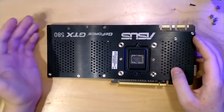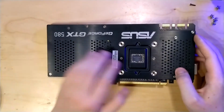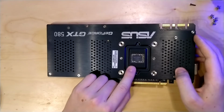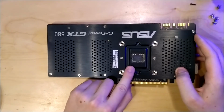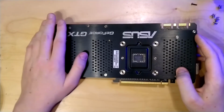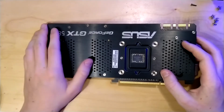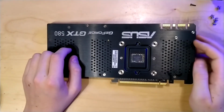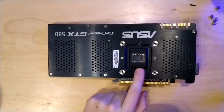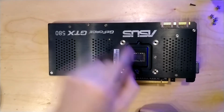Now, yeah, this is pretty much what these Proadlizers are intended to be used for, but actually I only ever saw them on one other card, being the Gigabyte Radeon HD 7970 Super Overclock, or SOC for short, where they used 5 of these just strapped to the VRM, which was probably because AMD didn't allow them to put them here where ASUS put this one Proadlizer, because this is actually where they are intended to be placed.